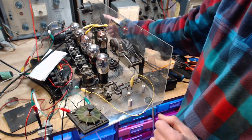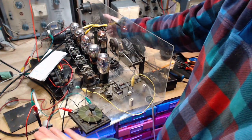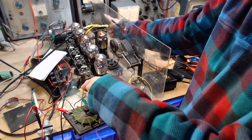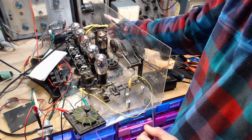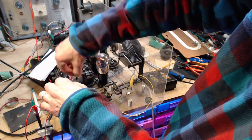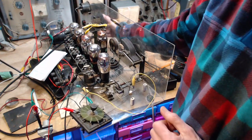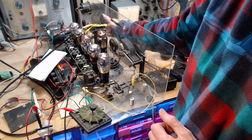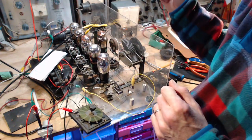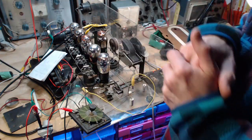So the way that antenna is built, the pickup coil is a single turn of wire. It's essentially a short circuit, so the impedance of this is extremely low. I've got it attached past a resistor. What if I attach it not there, but here? Not going to make any difference, eh? Should be 640. I still have this tuning capacitor to work against this coil. I still got lots more to build up on the front end.